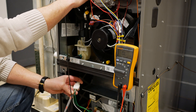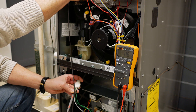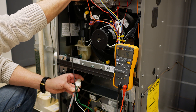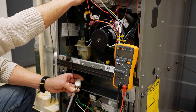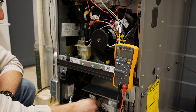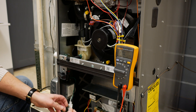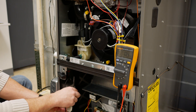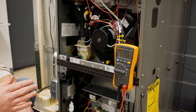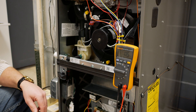If you have a bad connection, make sure that you scratch the casing to ensure a good electrical connection. Anything over 1 to 1.5 ohms of resistance, you need to look into that — it could be a problem with a loose burner or corrosion within the system. We're also going to check back at the common on the transformer, which should be grounded there and show a perfect electrical connection, and then check between the neutral wire coming in to make sure there's not a problem on the power supply side. We've verified that we have a good chassis ground for that flame current to travel from the burner all the way back to the control module.